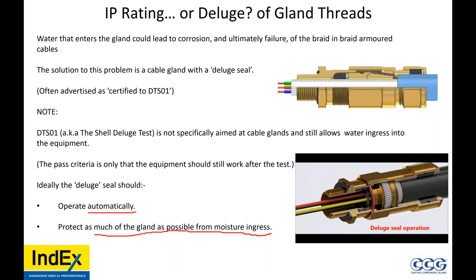What about lanolin grease? This is an Australian and New Zealand idea. Lanolin grease is okay for warm environments — it is not good for cold environments. Once you start getting below 5 degrees and below, it hardens. Greases for flame paths must not harden. So it's an option, but there are better options that are good from minus 60 Celsius to plus 400 Celsius.